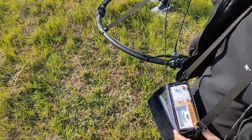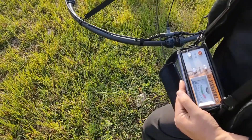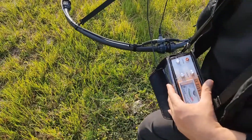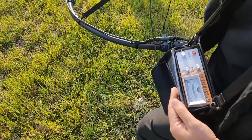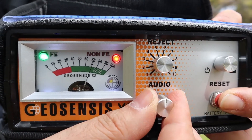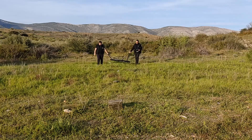For searching, maintain frame a little higher. If ticking is still audible when coil is raised, calibration is correct. If ticks are lost, press reset with the coil held that high from the ground. For special occasions where ticks are lost, hold reset and simultaneously increase audio. Release reset and raise coil a little higher. Ticking is audible — now start searching.